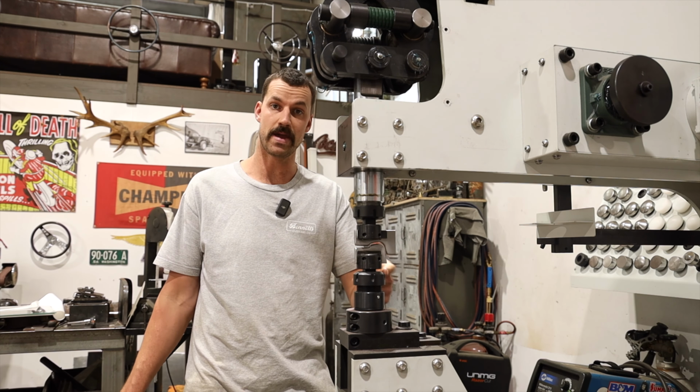So the cleaner that fitment is, spend as much time as you need to make sure that is as perfect as possible, so that you can just run over the top with a little bit of filler and keep that consistent heat right across, so that you can hammer it out and you're not going to have any waves and imperfections. That's going to be your best thing. So now you can see how clean this line is.